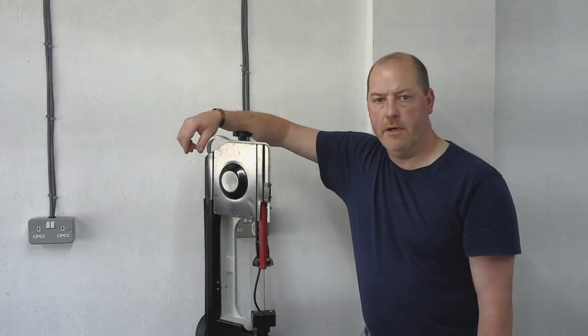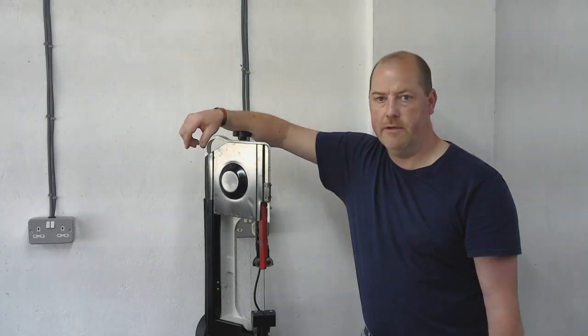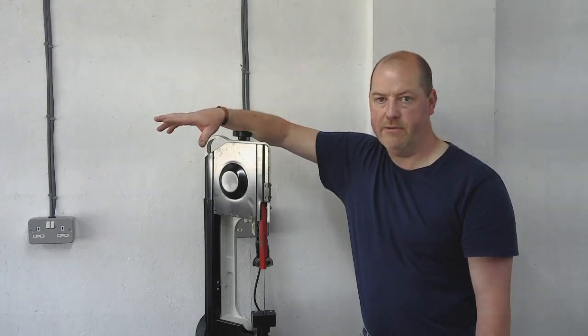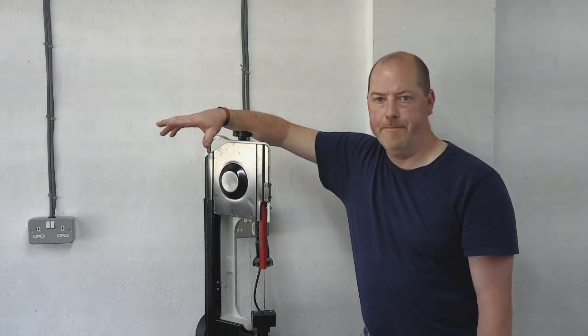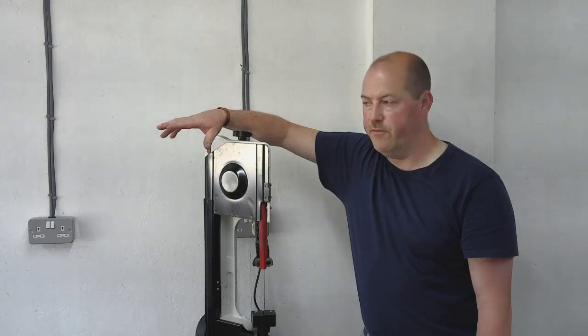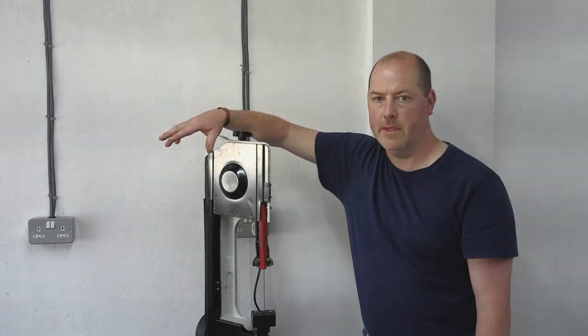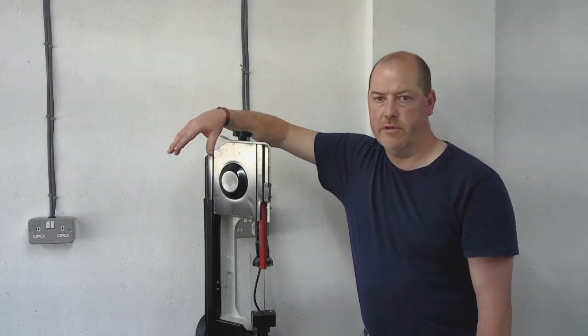That's gone well. It has highlighted, as I suspected it would, the issues I've got with the lathe, with the compound slides, with parting off. You know, it didn't have everything in its favour. It was case hardened stuff, but even so, it was clear that it was struggling. So I've got some work to do with that lathe.